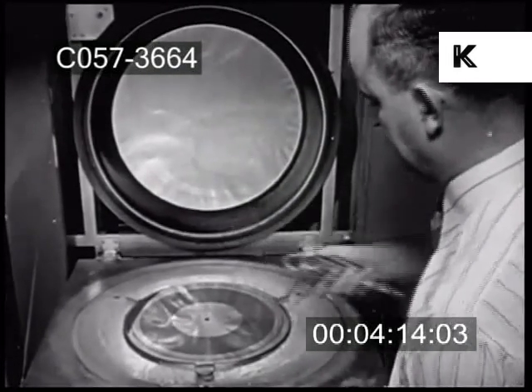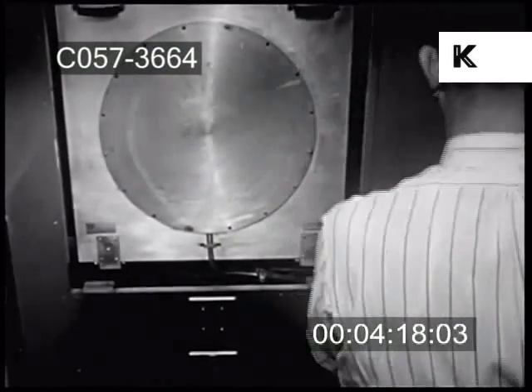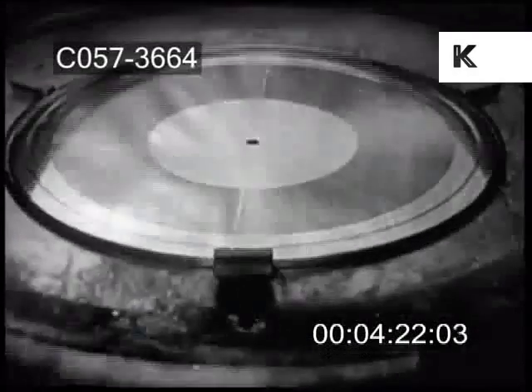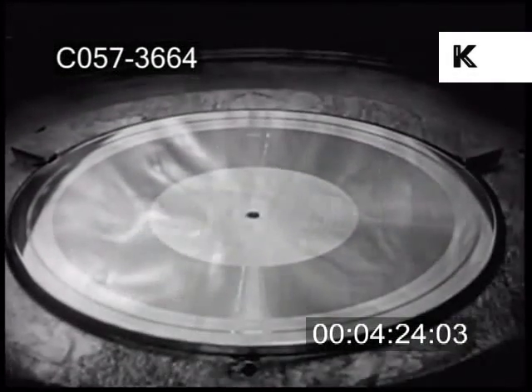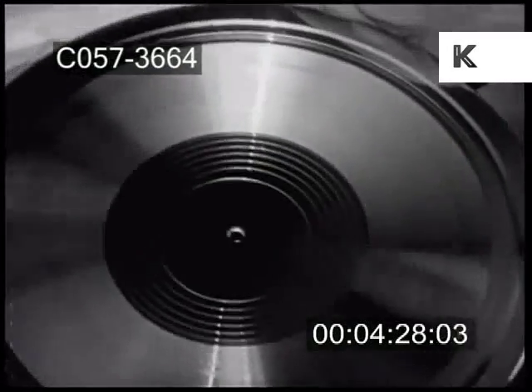When the recording is finished, the soft disk is washed with nitrogen and put into a chamber with a block of pure gold. A 2,500 volt electrical current, I was amazed to learn, bombards atoms of gold onto the wax, coating it completely.